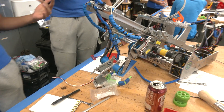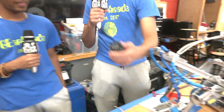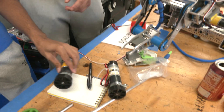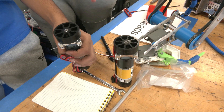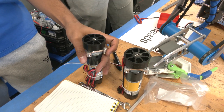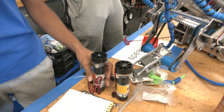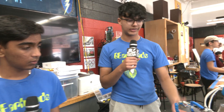That's a simple overview of what our robot is so far, and we're looking to add a couple more things before the 30 hours are up. We're looking to add a two-motor system with two compliant wheels that spin in opposite directions, mounted on a channel at the back of the robot. We'll use that to launch an airplane above the two ridges to hopefully get into the first zone. We're going to continue working over the next couple of hours and then start implementing software. We haven't thought about autonomous yet, but this is our basic system that we're going to ride with.